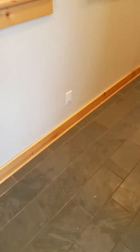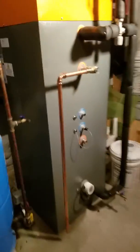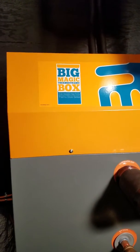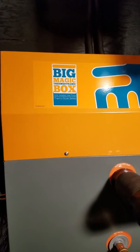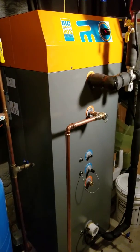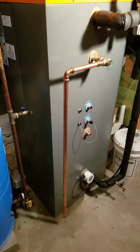What's not traditional about it is what's heating the slab out there. So I'll show you real quick. We have a solar assisted heat pump. There's a compressor in the compartment up top here and a refrigerant panel outside. It's absorbing heat from the outside, and there's a coil on the inside of this tank that the refrigerant goes around and heats the water inside of this storage tank.